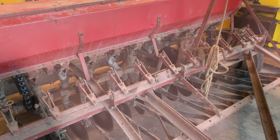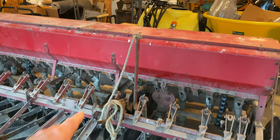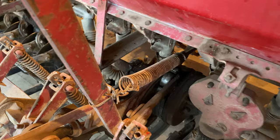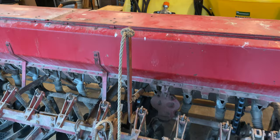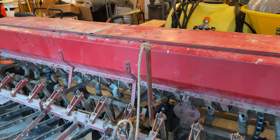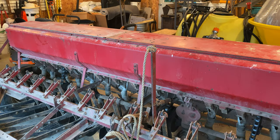Another thing to consider with your grain drill is how you're going to set the discs down and up. There are two ways. Number one is manual — what you're seeing here is a manual system with a very complicated cam system down in here that some brilliant guy put together. You pull on the rope, which pulls the lever, and it sets the discs down. When you're at the end of the row, you pull that rope again and it resets — over the next couple of feet it raises the discs back up. It's really simple. You don't need hydraulic outlets on the back of your tractor.